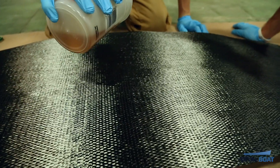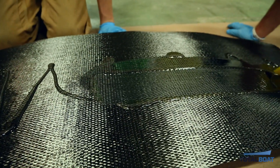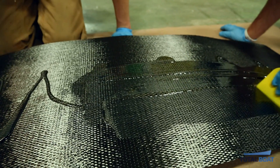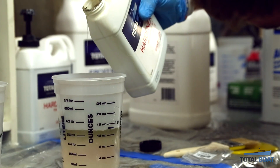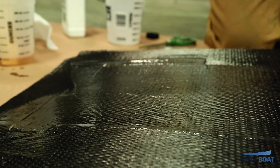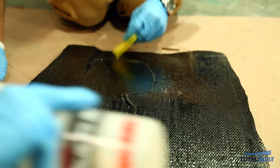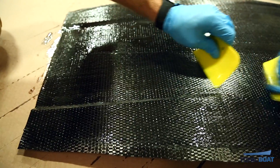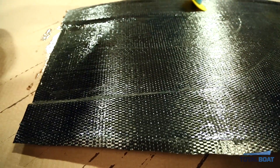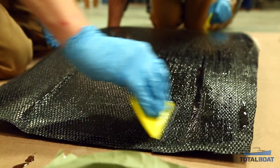We first paint the foam with epoxy to make sure it's fully saturated. The epoxy we're using is TotalBoat 5-to-1 — pretty simple: 10 ounces of epoxy and 2 ounces of hardener. Mix it up, make sure it's well mixed. In this case I'm using a fast cure epoxy since I have two people helping, which lets us move quickly. The only real difference between working with carbon and fiberglass is you can't tell when the carbon is wet out — you can't see when it's fully clear. Everything else is pretty much the same, except carbon is a bit more expensive, much stiffer, and a bit stronger.